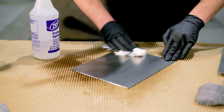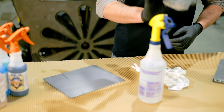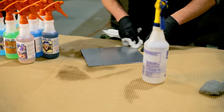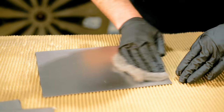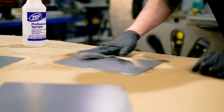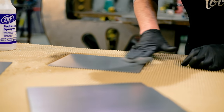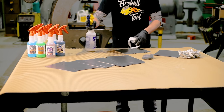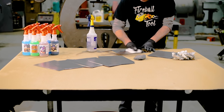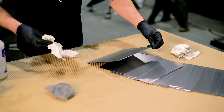In order to clean the plate you can sandblast it or wire wheel it. I'm going to use steel wool to clean it because the guard is so big I can't put it in my sandblaster, so I'm going to replicate this test with steel wool. All the oils need to be off, just like you were painting it or applying any other finish. All these patinas cost me about $200 — they're not cheap, but it's really hard to achieve this look without them. This is a very quick finish; you don't have to wait for paint to dry or send something out to powder coat.